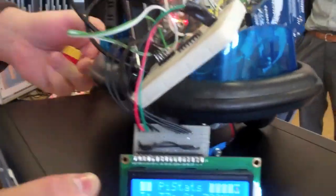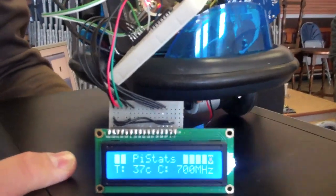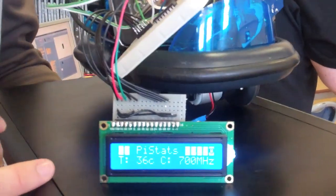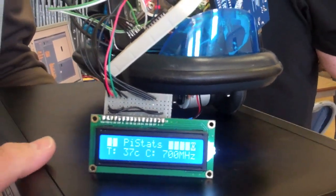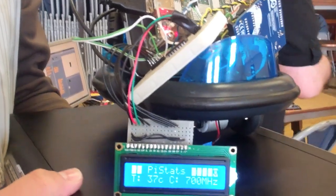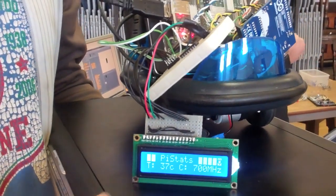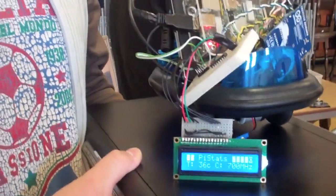The other thing being shown is the LCD display. It's running through a standard HD44780 controller, direct to the GPIO. With the latest update it outputs the temperature as well as overclocking status — it'll display them on screen in real time. If you give it a lot of instructions it'll jump up to a gigahertz, and when it's sitting idle it'll drop back down to 700.